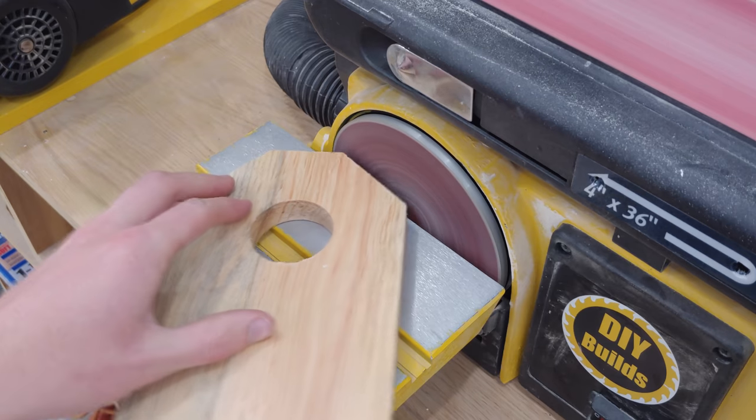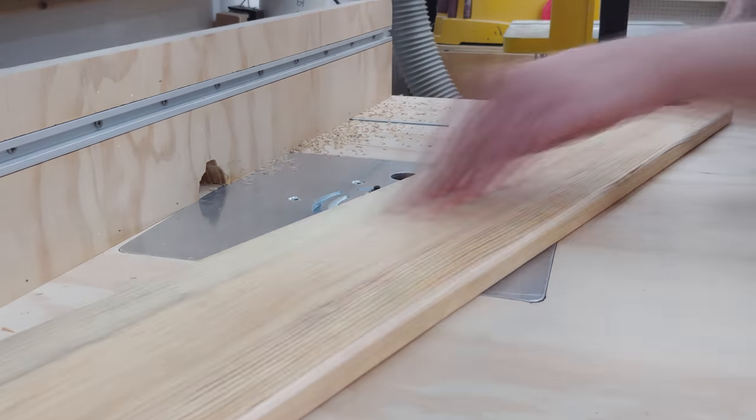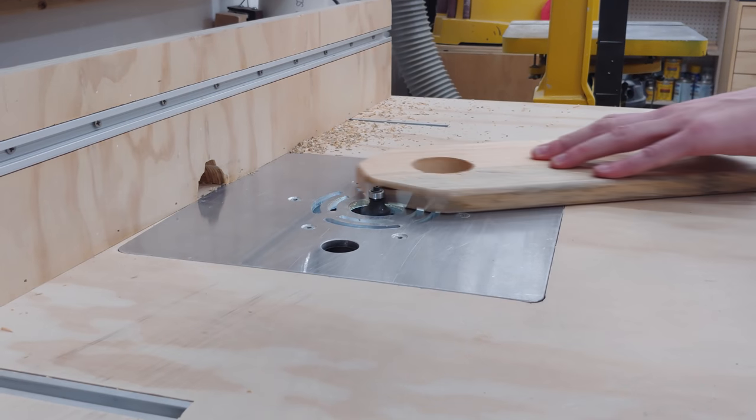Next I chop the end off my old water table waterfall pipe as it won't be needed anymore and I want to reuse as much as possible. I then chop two pieces of 1x6 material to 4 feet and 3 feet respectively, set my miter saw to 45 degrees and chop off the corners of the top of each board. Using my combination square I mark the center from the side and top, then bring both boards to my drill press where I use a forstner bit to hog out material for the pipe to slip through, creating a very nice tight fit. At the disc sander I round off the corners before bringing both pipe support boards to the router table with a quarter-inch round-over bit to ease all the edges for a safer feel, since the kids will be touching this.